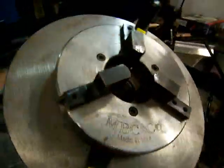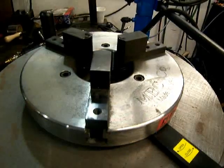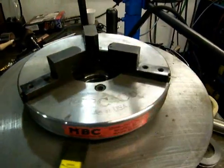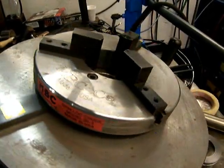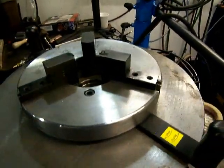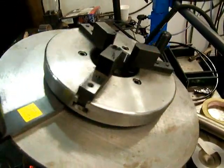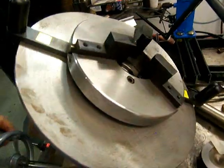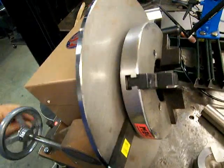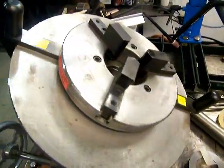This MBC positioner also has a crank handle that lets you go from horizontal to vertical in nothing flat. Once you get the angle you want — anywhere in between horizontal and vertical — you can lock it in place with a lock nut. You can change things on the fly. It's a good, simple little positioner — no fancy control box, just a variable speed knob and a forward and reverse switch, plus the tilt crank with a lock nut.